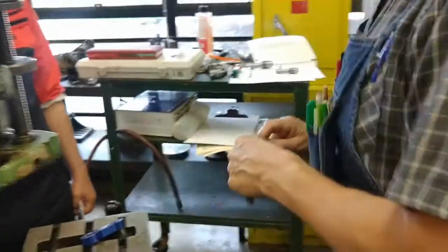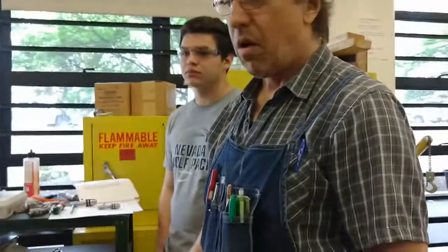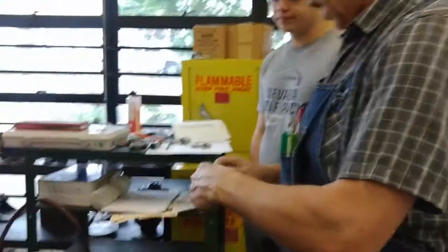I can't tell you how many students, dozens of students, have come to me with problems because their thread was oversized, and we went and measured the depth of the hole, and they'd only drilled a half inch deep, or 5/8 of an inch deep. Same thing with the reamer. Oh, I thought I drilled deep enough, but they didn't pay attention. Okay, so just a quick check tells you you've gone deep.